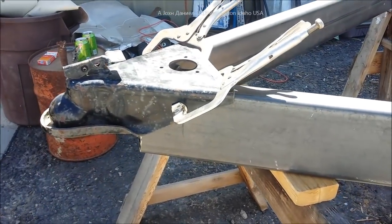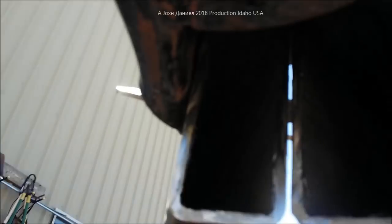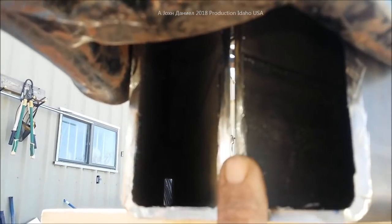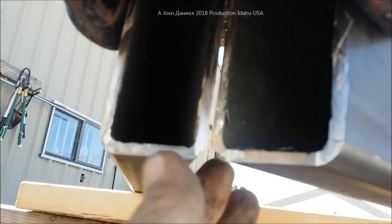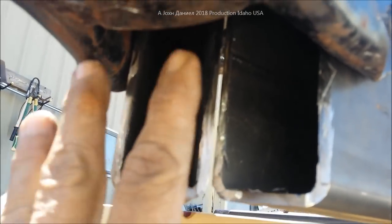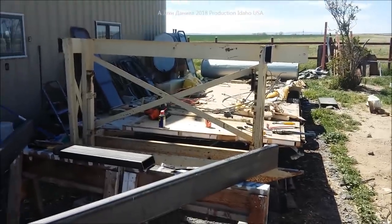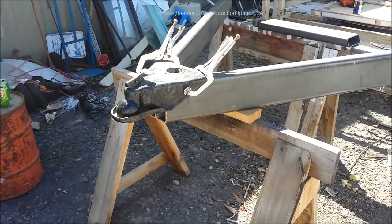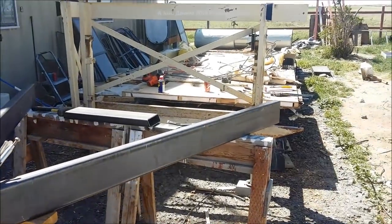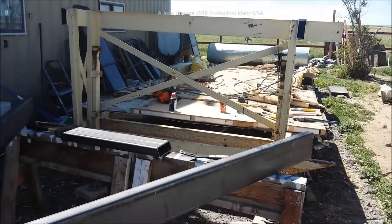So this is the build for putting it together. Got everything aligned, got the measurements exact, got our cuts so that we can even put a piece of bar behind this, piece of probably 1/4 inch rebar behind this, and then fill everything in with weld here, and then grind it down and put a piece of plate across it, recycling an old 5th wheel. So a pair of 6,000 pound axles, and a 24-foot 7-inch bed on it. That's what the bed ends up being, 24-foot 7. Should be able to haul just about anything.